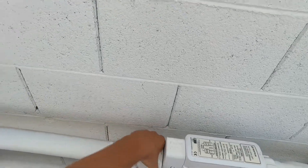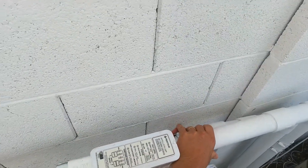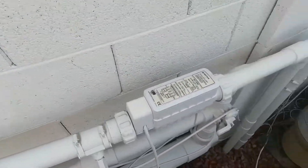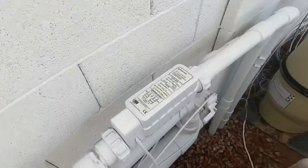When it goes back on, just a little bit of snugness. With the Pentair, if you have it horizontal, the body needs to be up. If it's vertical, it can be any which way. And that's how you clean your salt cell.